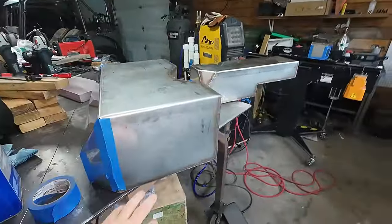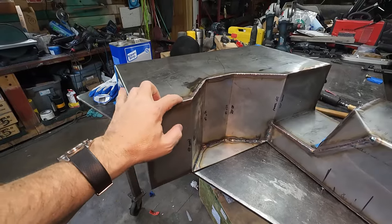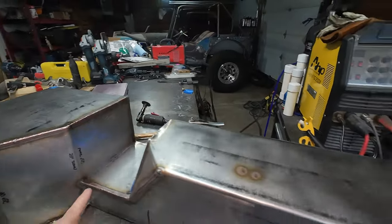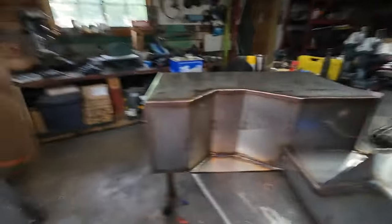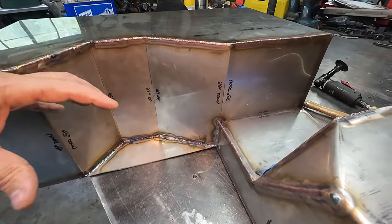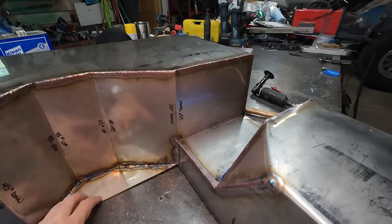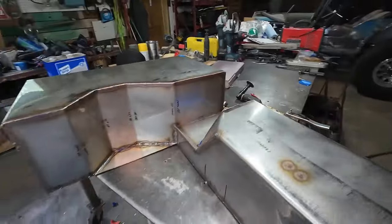Here's where I got to. Last time we worked on the other side of the tank — this time I flipped it over and basically did all the welding around these bottom seams, up here, over here, around here, all these verticals — all of that. Not much left, but this was the part I really struggled with: this inside corner here. It's super tight, trying to get your helmet, your head, and filler wire all in there. That was the last thing I did, and this was warping a little bit, so I decided to call it for the day. It was about two and a half hours of welding.